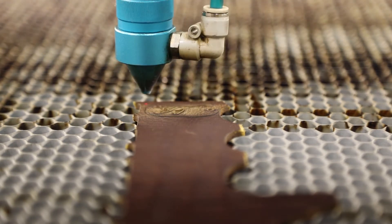And of course when it finishes, the TL timer feature will leave the air compressor running for a little while and the exhaust running for a little while longer for a preset amount of time that you can adjust before it shuts them both off. This is done so the laser can't accidentally be left bleeding air out of the compressor unnecessarily or pumping air out of the building continuously — which basically pumps all of your air conditioning or heat out depending on the season.